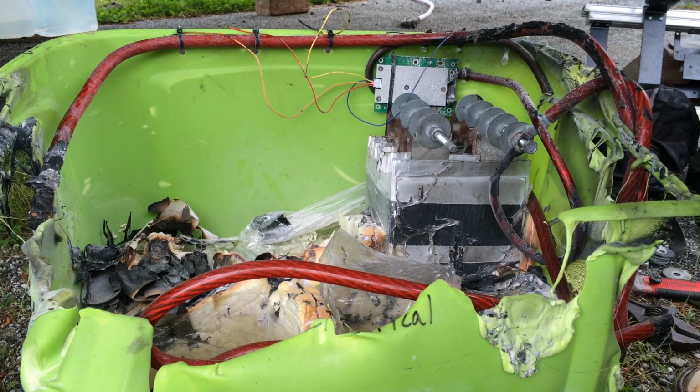This 12-volt inverter was able to draw something like 150 amps. This is probably only good for 40 or so amps, I don't remember, but I know it's not 150. Plus you can tell by the wire sizes and how big the terminals are there. It's just not big enough.